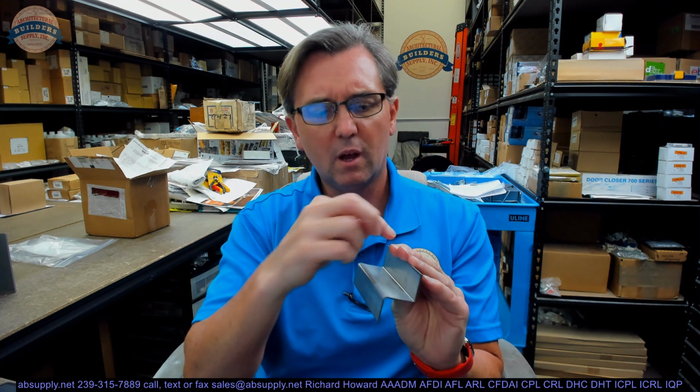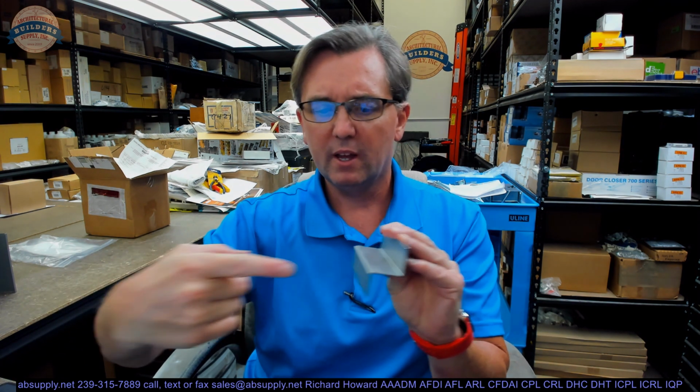I thought I actually had invented this in the early 90s, when I had said to myself, wouldn't the hollow metal manufacturer that we distributed, my family, since the 1970s, Kewanee Hollow Metal in Kewanee, Illinois, which went out of business about 2005, they didn't have a Z anchor or an anchor like this. And I thought, boy, for metal stud work, this is all you need. If we just cut a piece of flange like this and weld it to the inside of the frame, the framer can bring his stud up to it and zip right through it with his mini screws.